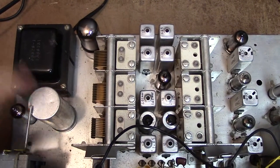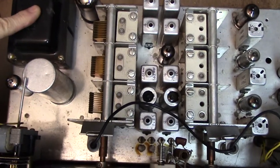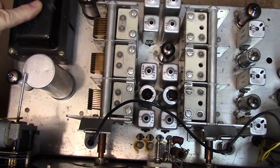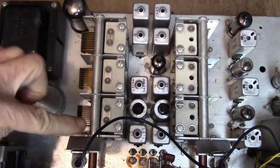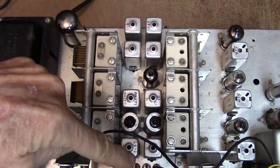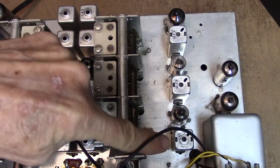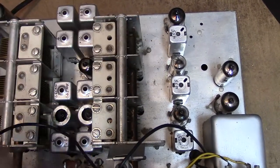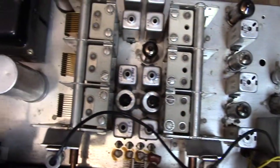It has the big electrolytic capacitor, the large power transformer. Look at the big tuning coil, the tuning capacitors, a lot of tuning coils, and it also has three IF cans — these are 455 kc. We're going to talk about some of the problems of this radio and the difficulties in converting to solid state.